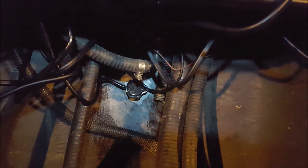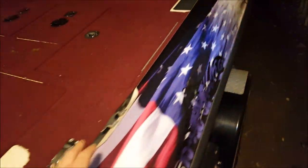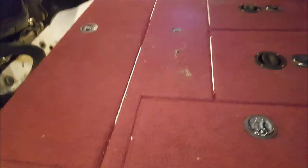For the temperature sensor that came with it — it's a separate wire — we ran it through here and out through that boot, and worked it down to the existing transducer location. We actually connected the temperature sensor to the old transducer and we're just going to keep the old transducer in place in case of emergencies or if we decide to go back to that style. It just made sense to leave it in place.